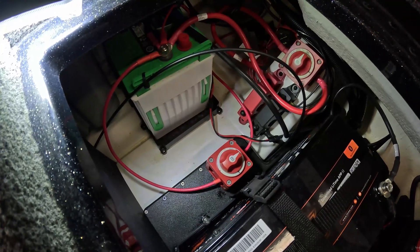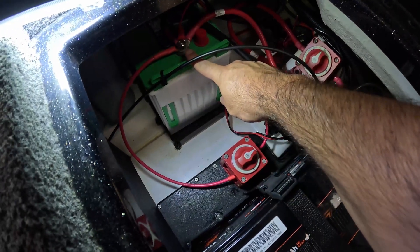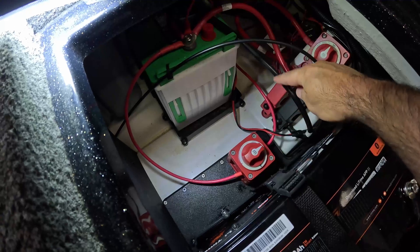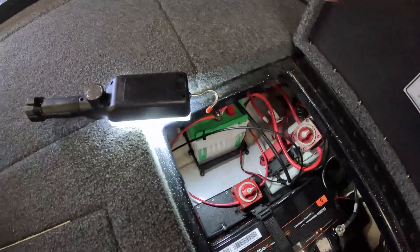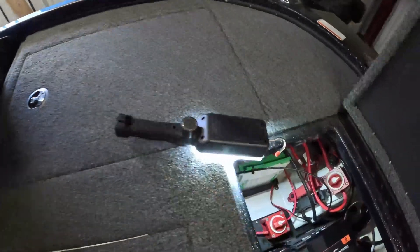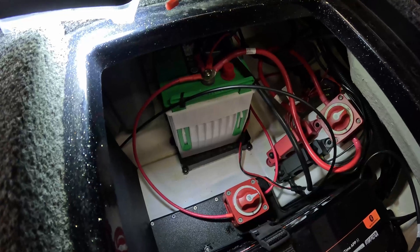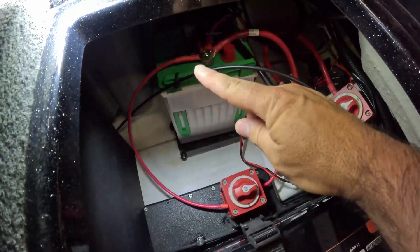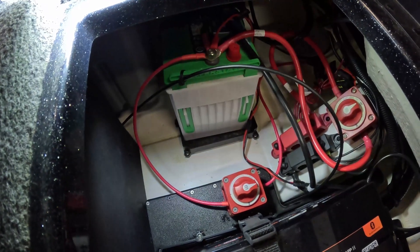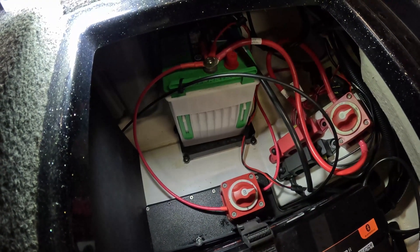Here in the battery compartment is that Garmin power supply. It is connected to the main house battery here, and this is the wire I installed to this switch. From here it goes up, tucks in under the side of the gunnel of the boat, and goes all the way around to the front. So there's a significant length of wire that is not protected by the fuse. What you're supposed to do is install a fuse in this area here so that the entire run is protected. That makes sense looking back on it now, but it just didn't occur to me at the time.